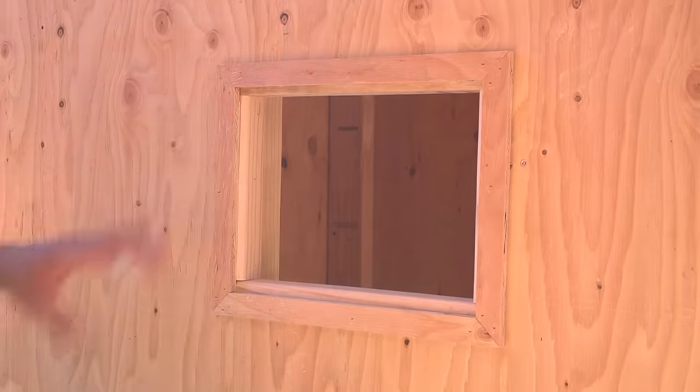Once I have everything beefed up appropriately, I make up a nice lid for our nesting boxes and move on to some dividers. The dividers are just pieces of 2x4 and some plywood because we do want to make sure that each hen has a bit of privacy when laying their eggs. Now that we have our nesting boxes taken care of, we can move on to finishing up our trim. The only thing that's different with this trim is that I placed a 45-degree angle at the very bottom to make sure it doesn't get in the way of the lid when we open the nesting boxes.